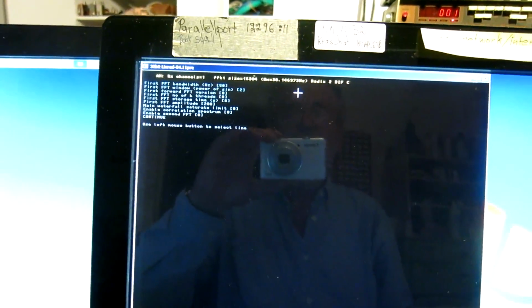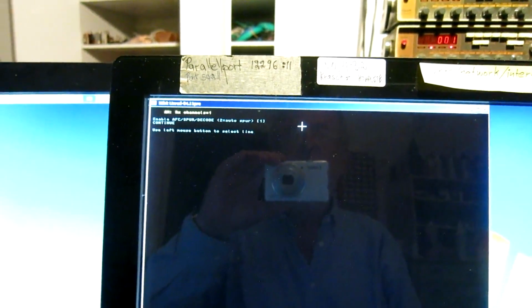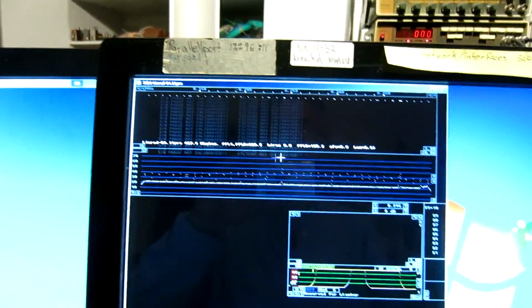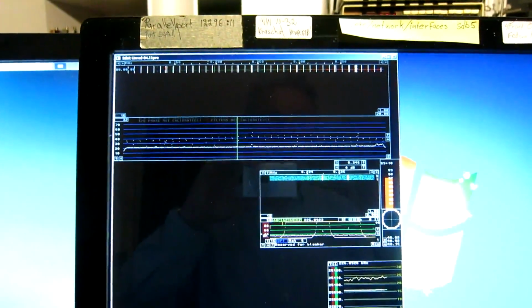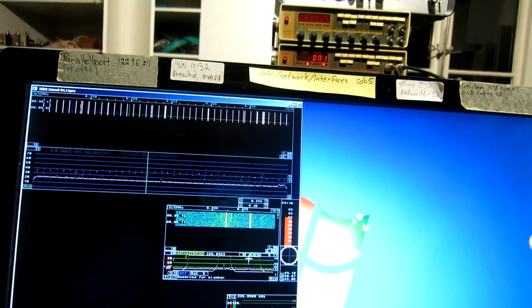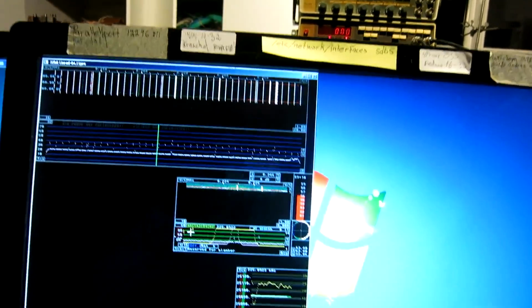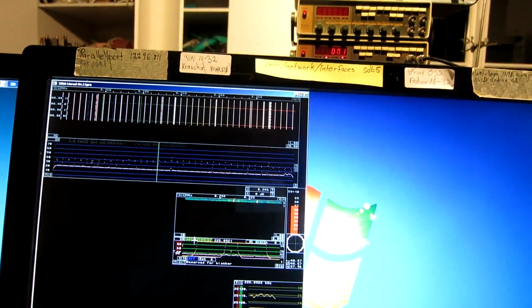I'm now running without the second FFT, but I have the spur removal algorithm in manual mode. That's one here, and many spurs possible to remove. And here is the same recording, and I click on this weak signal. And the carrier is here, and the lawnmower, one of the overtones, is here. And it dominates, and it makes it difficult to hear anything. I could reduce the bandwidth. And then I hear something. But go back to a normal bandwidth.